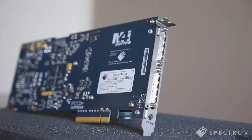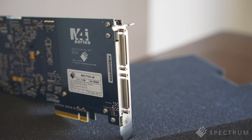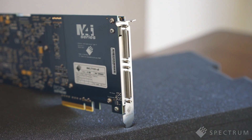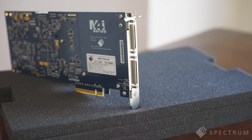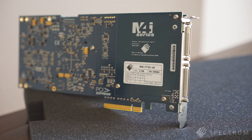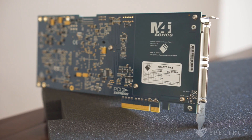The cards are equipped with two VHDCI connectors for the digital channels as well as the external trigger clock input and output. These connectors also provide two separate multi-function input outputs that can be individually programmed to perform different operations such as trigger out, status out, armed, triggered, ready, etc., as well as providing additional asynchronous I/O lines.